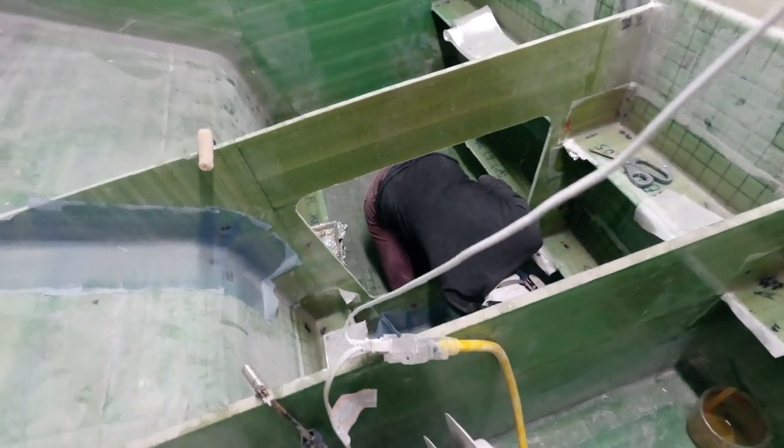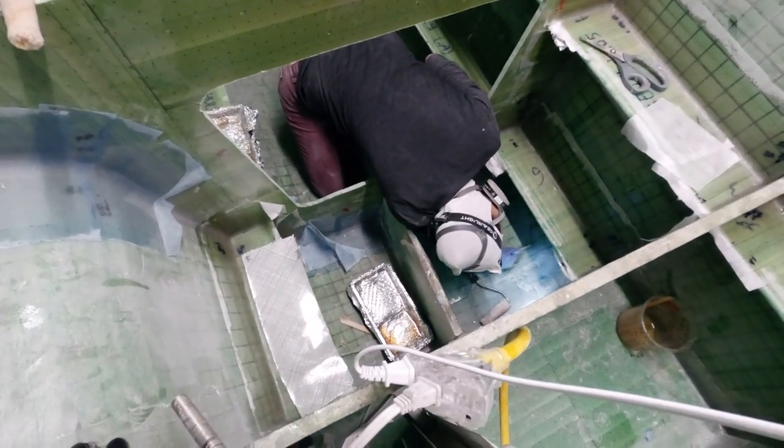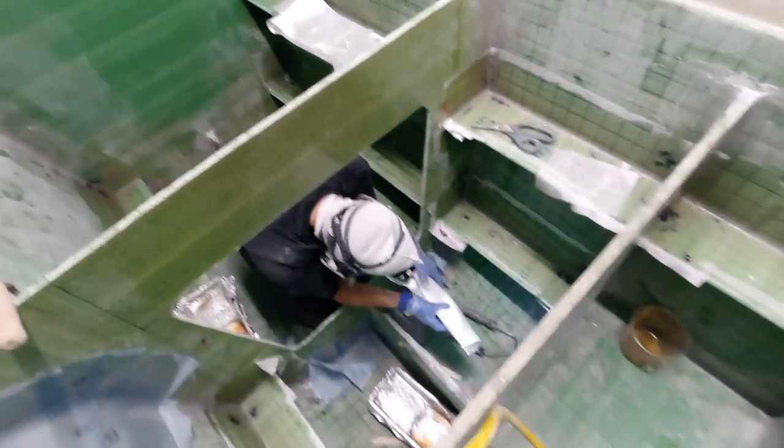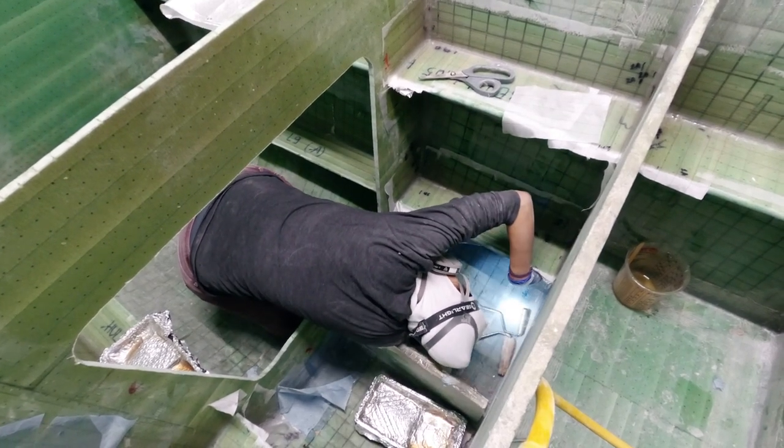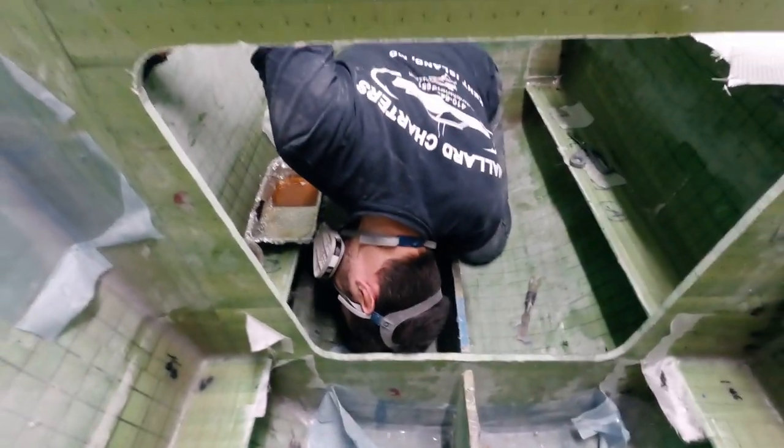I have to say, last night we finally checked off the list one of the projects that Matt and I had been dreading the most, and that is in the engine bay areas. There are these structural webbings that go in, and we had to glass the top and the bottom sides, and the sides underneath, closest to the bottom of the hull. Extremely hard to get ourselves under there and do a proper job, but it actually worked out okay, and now we have those done, so we get to keep working further in the area and focus now on the bedroom, or the beds. We're getting those figured out exactly how we want them to sit based on the space and the kind of mattress we eventually want to put in there.